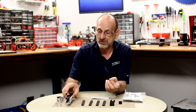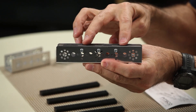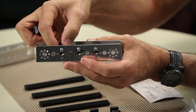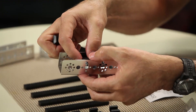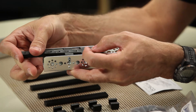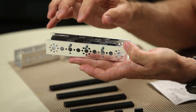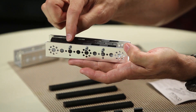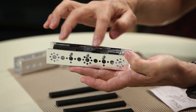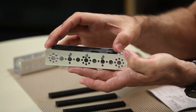When you put it together like that, the slide then goes in with the rack side down. I've left these loose on purpose because one of the important tips you need to be aware of is that if you don't get those slide bearings parallel to this surface, then that rack will be in a bind as it goes through and it will cause extra friction and won't work very well.